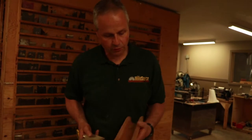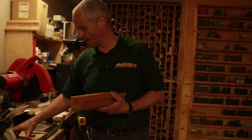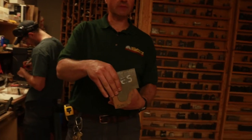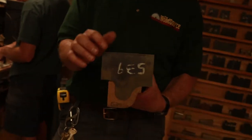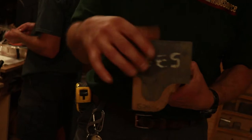So Casey, we're in our grinding room where we sharpen all our own equipment and make all our own knives. We can reproduce any molding. We had a request a few years ago for someone who wanted a piece of wooden eavestrough, so what we do is make a template to whatever profile is needed — someone can give us a CAD drawing or a piece of material and we will make a template. You can see it cuts the groove for the eavestrough, and this was matching a wooden eavestrough on a historic building. So we cut that template.